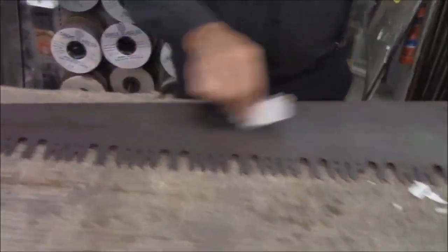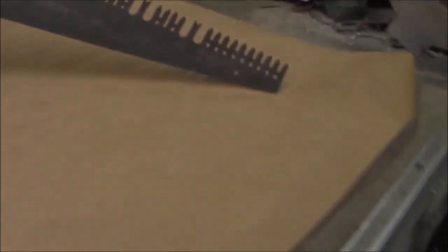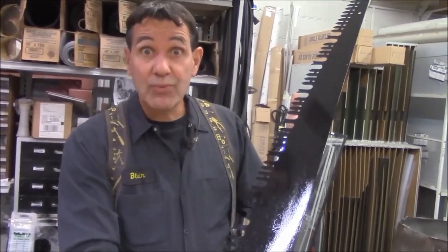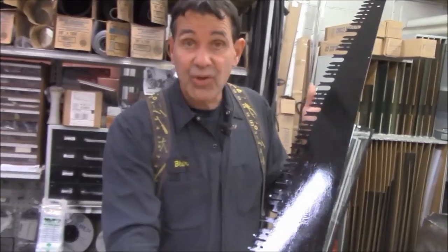But this was the terrible side, and this was the good side that we did earlier. Now we're going to show you that you can just paint this with an oil-based paint — you do not need to use a secondary primer. So this rust remover not only does a stupendous job of getting rid of the rust and the oxygen causing the oxidation, it is also our primer. We let our product cure and now we're going to take some all-purpose gloss black and apply it right to this quickly prepared piece of metal. We did not sand it, we did not go out of our way — it's just a quick fix. This saw blade could have easily been your steel garage door, your storm door, your handrail, your porch light. This rust-inhibiting coat we put on there is for any piece of rusting metal.